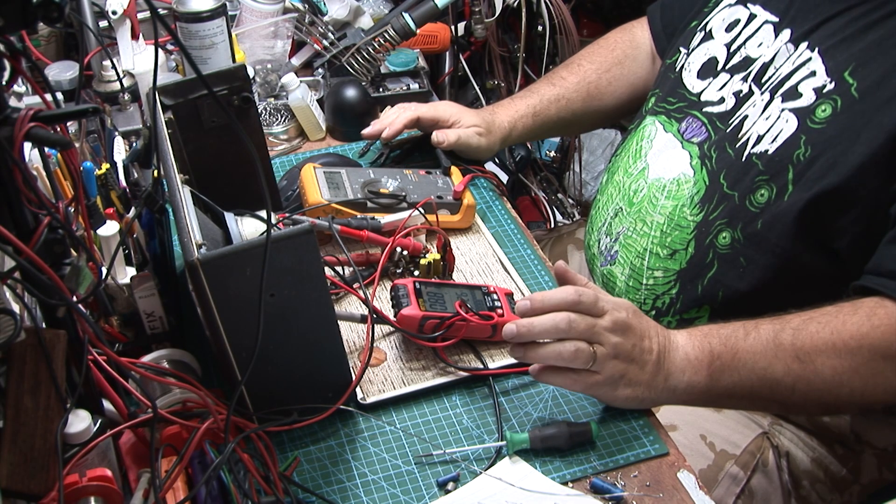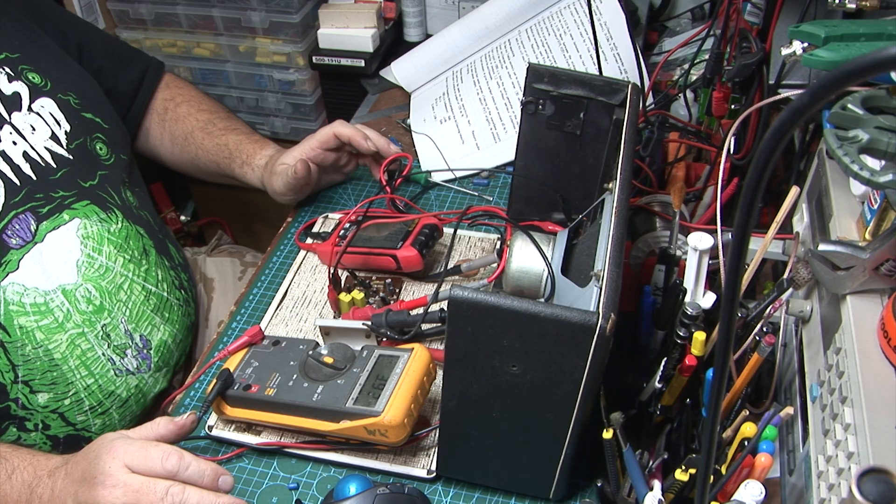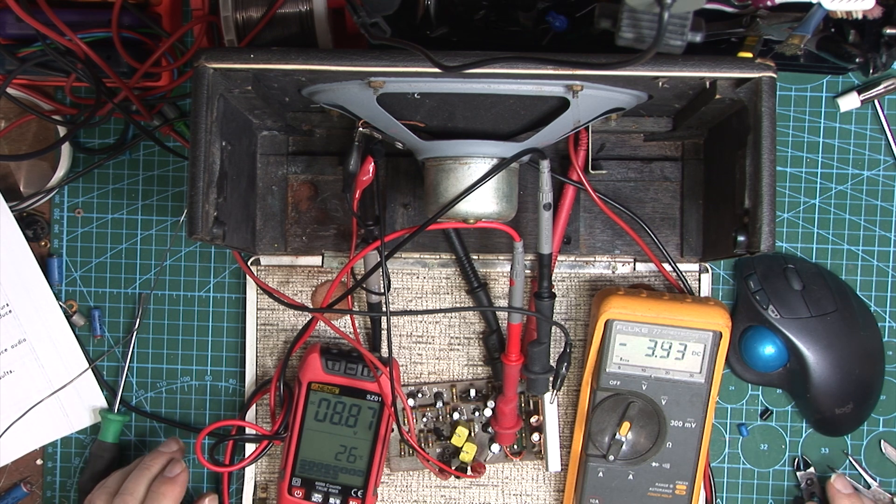At this point it's probably time to say that the amplifier board is done. There's nothing further to do on it at this stage except undo the short circuit and remake the link — that's just a matter of either bridging it with the two existing wires or taking that piece of wire out and putting a new piece in. You could even use the shorting link from the back of the board. It's drawing around about 20 milliamps in this mode — not a lot of current at all. With zero input it's sitting there just idling quite nicely.